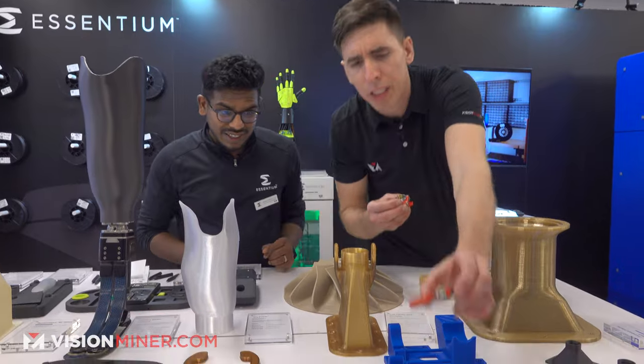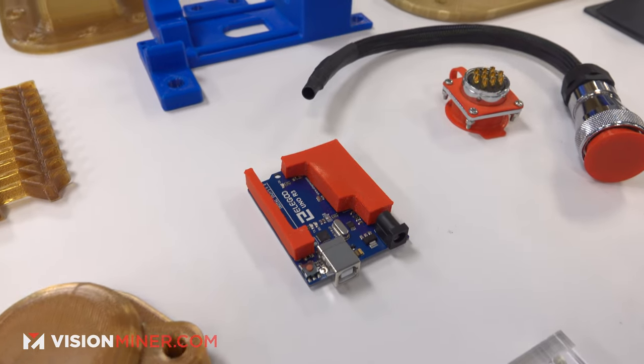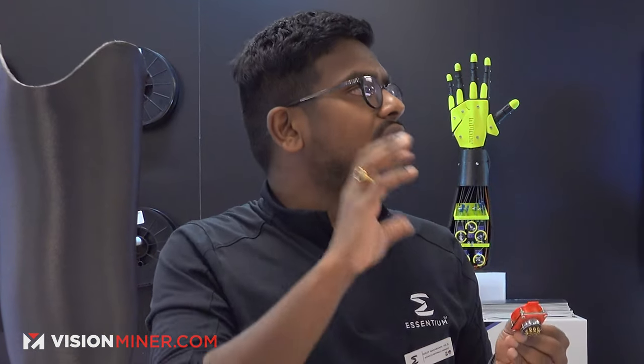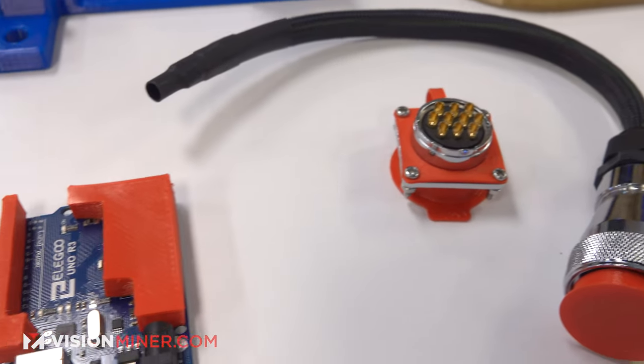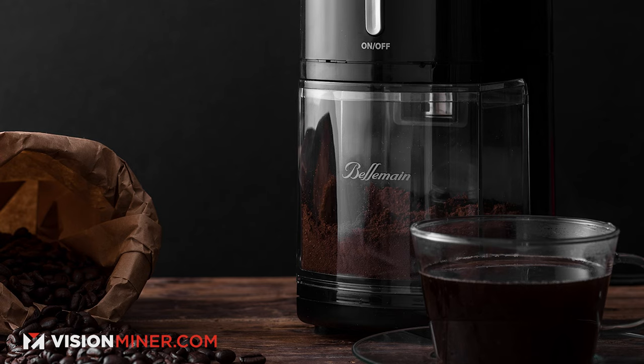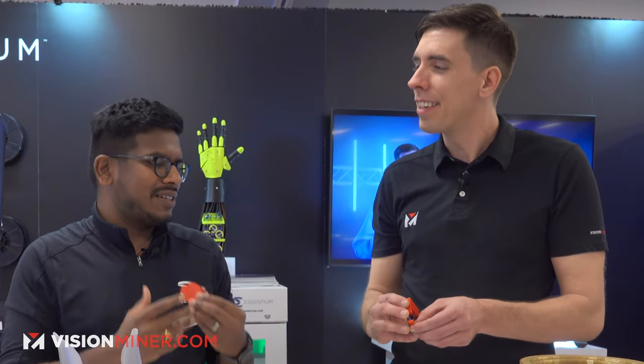Let's talk about these red ones — the red is very specific: anti-static, as opposed to ESD. ESD-safe materials need an active grounding to transfer charges. In a situation where you don't have active grounding — traveling in a desert or flying — you still need ESD protection on your electronics. That's where you need anti-static materials, which have inbuilt charge dissipation and don't need active grounding. These are called IDPs — inherently dissipative polymers — they soak up moisture, and water is electrically conductive. Similar to how a spritz of water on coffee grounds eliminates static in a grinder — water is antistatic and it doesn't need any grounding.